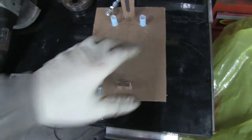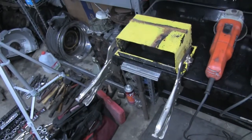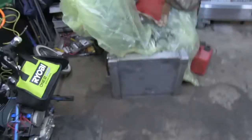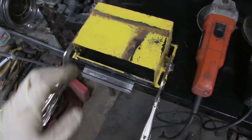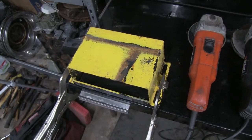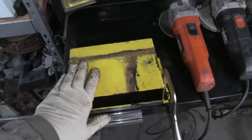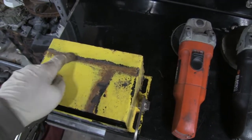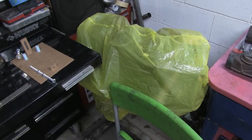So what I'm going to be doing is transferring this design on to this — I had this laying around, it was an old battery box off of a go-kart, which I was going to use on the engine run stand but I really don't need to. And if I really needed to, I can always just flip this upside down, put a couple tabs on it where it will bolt down and use it for two purposes. So what I'm going to do is clean the surface up, find my piston center line, describe my circle so I know where I'm going to be putting the pins in the posts, welding this up, and then hopefully later in the day I'll be doing some pistons and then some file fit on the rings.